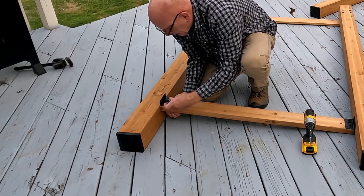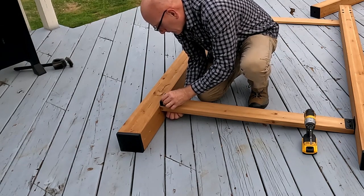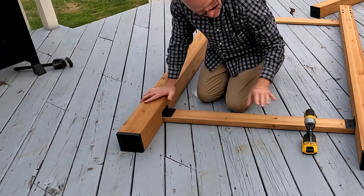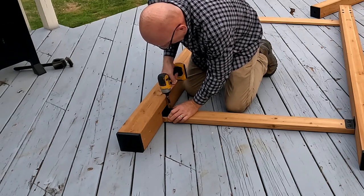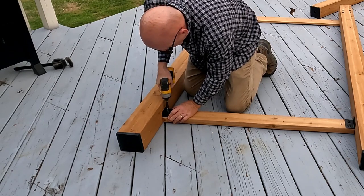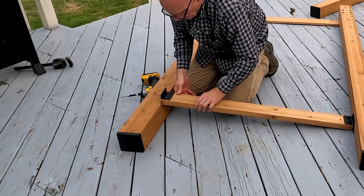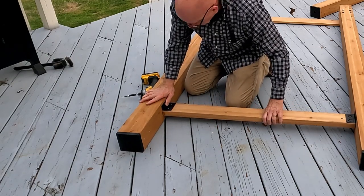You can see a pattern on this kind of stuff once you start putting it together. It can save you some grief trying to struggle and figure things out if you recognize the patterns. I know every time I go wood, I'm going to have a lock washer. I go metal to metal, I'm not going to have a lock washer. Okay, I just need to see which screws go in here.